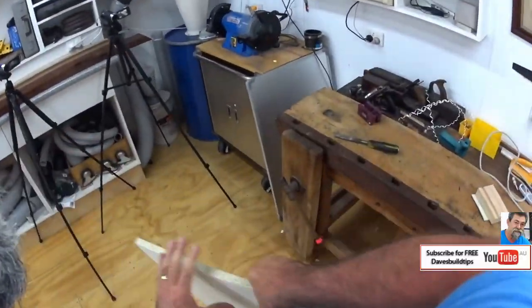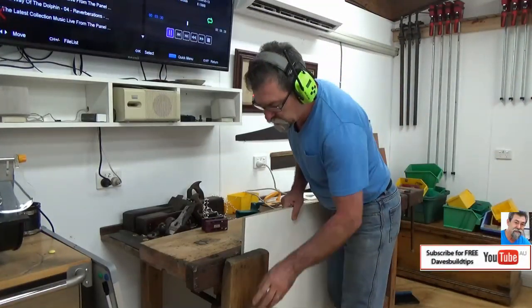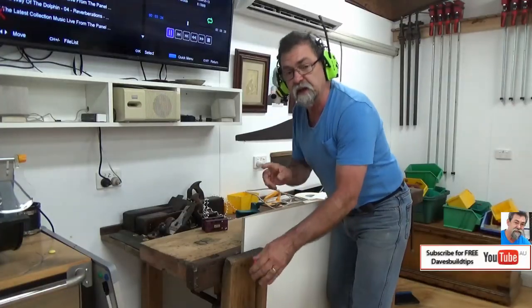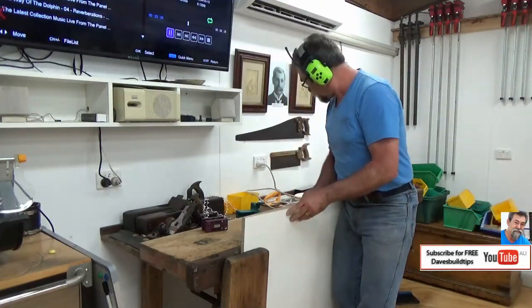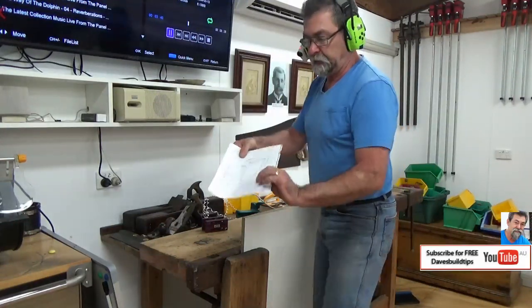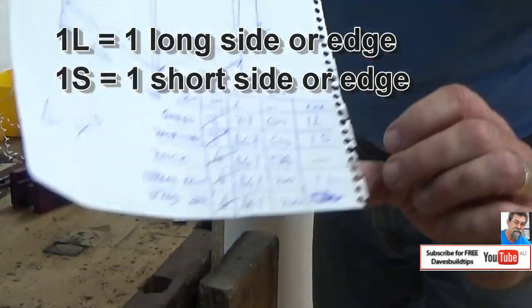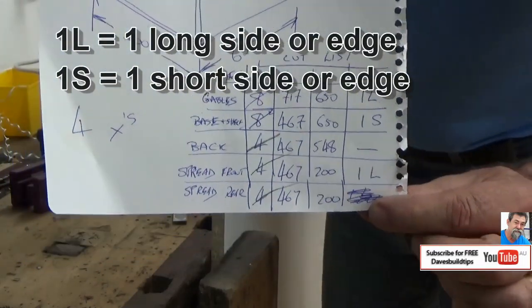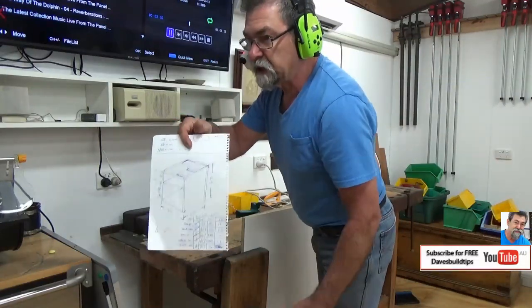You'll know how to do it. First thing I need to know is what side of the board I'm putting the edge strip on. I know how to do this because I write down: one long, two long, one long, one short — that's all I do. So you can see here on this cutting list that I've got down this side, it says one L, one S, all that kind of stuff. And that's how I work out on this particular drawing what's going to be exposed.